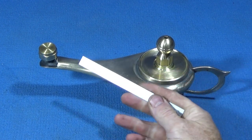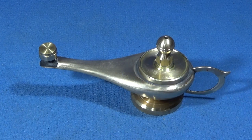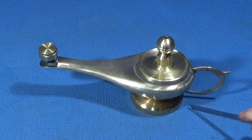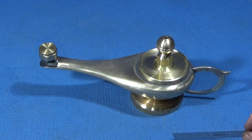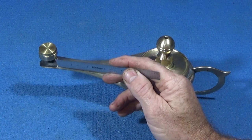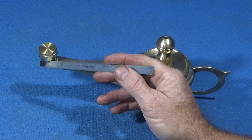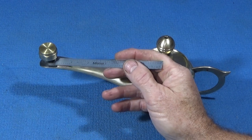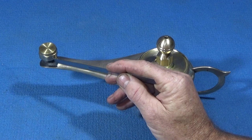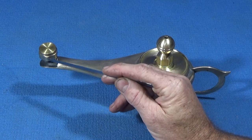What I bought in the charity shop is this part here — I'm not sure whether it's a jug or an ornamental oil lamp without working parts. It did have a taller, lightweight stand on it. This part here I made out of an old plumbing fitting, cut off and shaped to fit the end. I cleaned up the end with wire brushes on my Dremel, and I soldered this into the end of the spout. There were gaps left in there that would have leaked — it's a right-angled fitting.